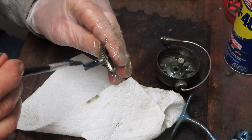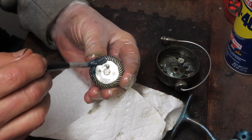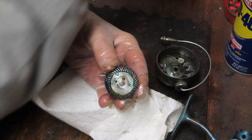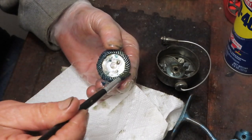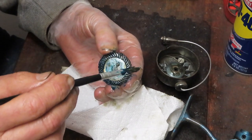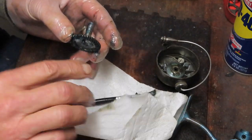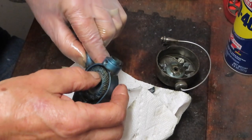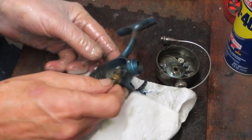Install by putting a little bit of grease onto the main shaft on the back so that it slides easily in the case. There are no ball bearings in this, so it nests into a bushing — make sure it nests nice and easily. Get a good amount of grease in here since it hasn't had grease in a while. Grease the teeth of the gear, the face where the crosswind block is going to ride, and the back shaft which rides in the case. The main gear goes in first, then the pinion gear goes in next.